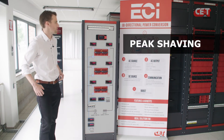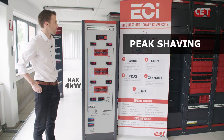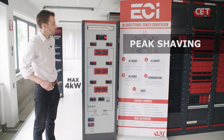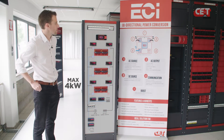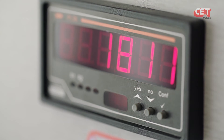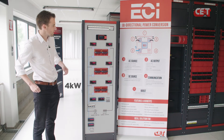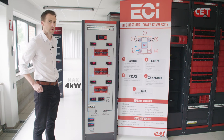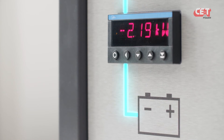As you will know, having a need for punctual peak power consumption can be costly. Here is how the Sierra module can perform peak shaving for you. For the purpose of this demo, we've set the AC input limit to 4 kilowatts. As long as AC loads are less than 4 kilowatts, the system can still charge the battery. But if AC loads increase and become higher than 4 kilowatts, as we show here, you can see that the power taken from the grid is limited to 4 kilowatts, and the battery is giving the delta power needed.